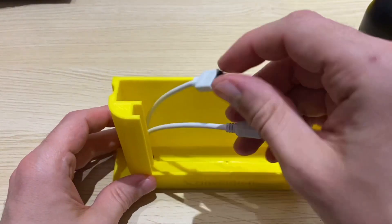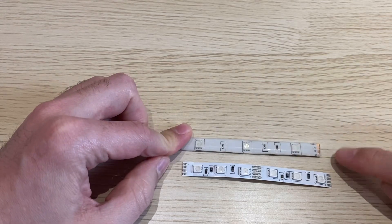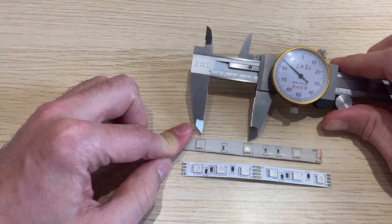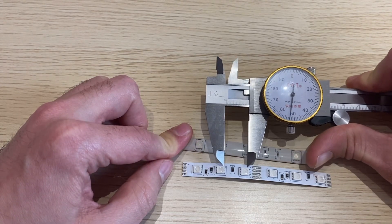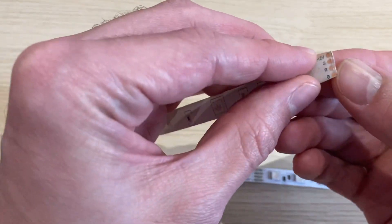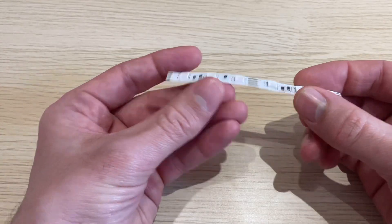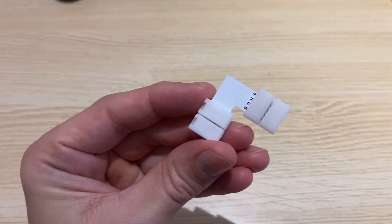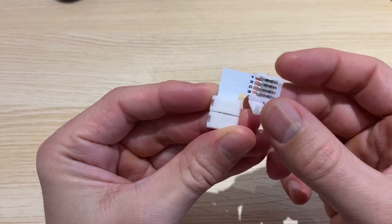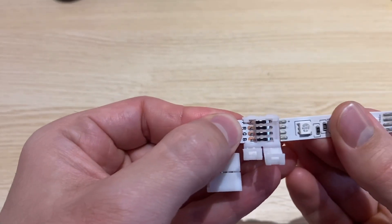The remote sensor and LED output cable are now poking up to the top. Let's talk about the new LEDs used in version 2. The old LEDs had a lot further spacing — about 33mm. The newer LEDs are spaced much closer, at about 16mm. Also, the original LEDs were encapsulated to make them waterproof, which wasn't necessary and was painful to peel away. The new LEDs are not encapsulated, making them much easier to work with. Another improvement was finding 90-degree corner clips — LED strips just slide into the connectors on a flexible PCB, saving a lot of time compared to hand soldering.